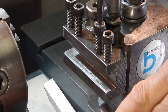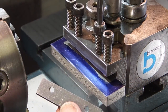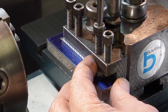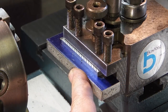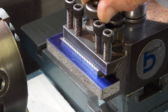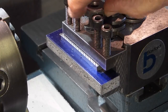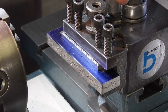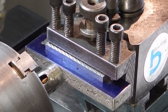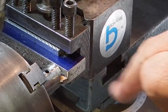The aluminium I'm using has been sawn off on the bandsaw on that side, and there's another saw cut on that side. So I want to make one side square. I'm just using a piece of packing on the top so that I don't damage the surface of the aluminium with the locking cap heads. Lock that in position. What I want to do next is put a fly cutter in the chuck, and adjust the height so the aluminium is near the centre of the chuck. It's not critical — just so the fly cutter cuts evenly each side. I'll check that I can move the full length of that piece of aluminium and that the cutting bit will travel right to the end.